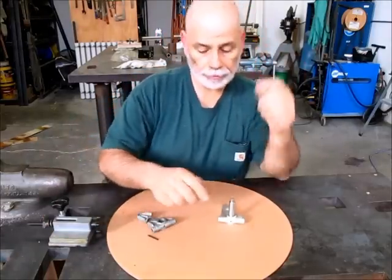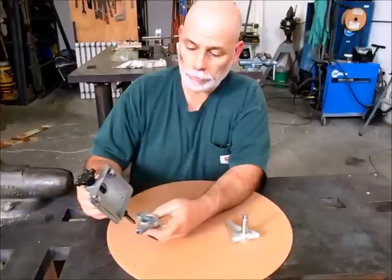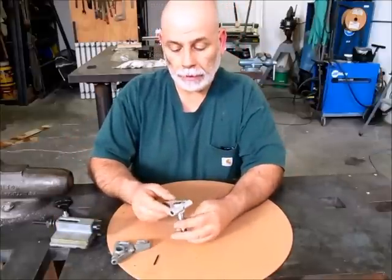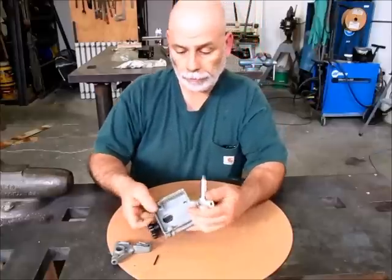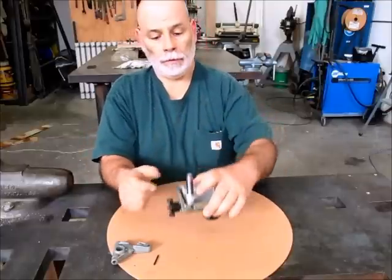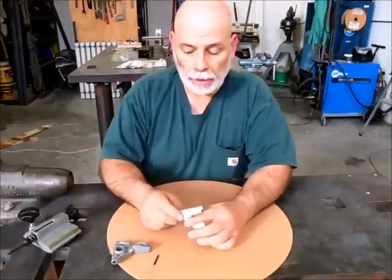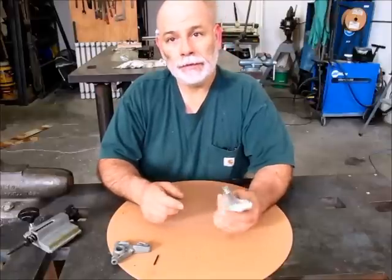We finished up this little bracket here. This is the little bracket for the bandsaw blade tracking. This is what we were given to start with — it's a bunch of busted junk. We recreated it in good solid aluminum and reused the original bearing shaft. It goes in like so, and this screw here actually causes this to tilt and change the tracking of the blade. It was an interesting little job — we showed layout, we showed how you can plot that, and we had a little bit of fun doing it. Anyway, that was a pretty good little job. That's the end of the story. Thanks for watching. I'm Tom.